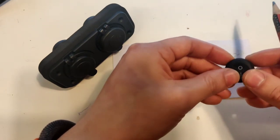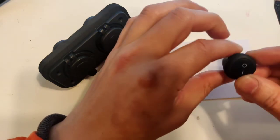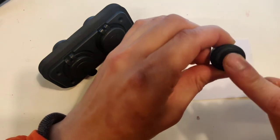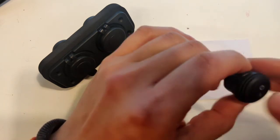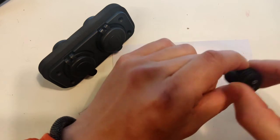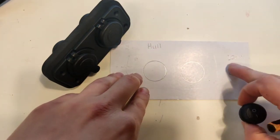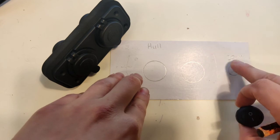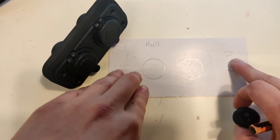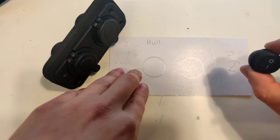You would push it, and it's a pressure fit, as in it's a tolerance fit. You push it in and they will jam up, and they will basically keep it locked in. And whenever you're using it, there's no pressure of it popping out. You're not going to be pulling the switch, you'll always be pushing against it. So that's how the switch is installed, and you can install it anywhere you want. As long as you get a 20mm bit, spade drill bit, quite nice, or a 20mm hole saw, and drill it out and install it. Simple as that.